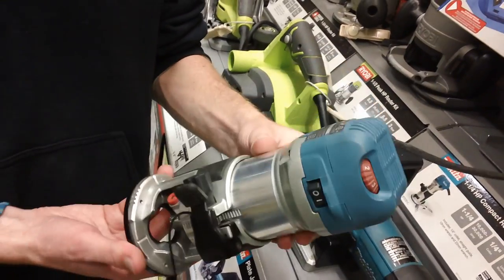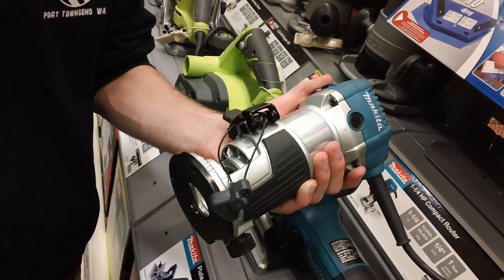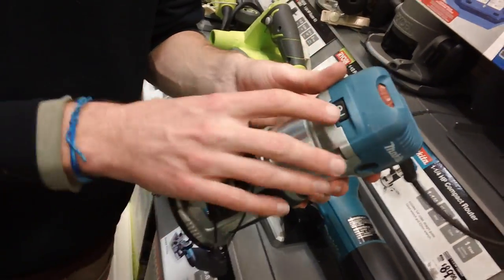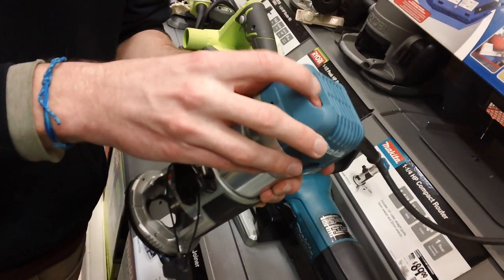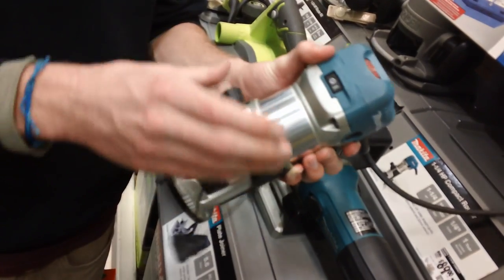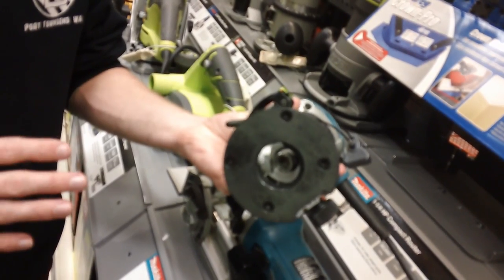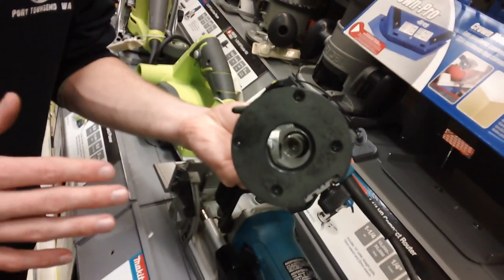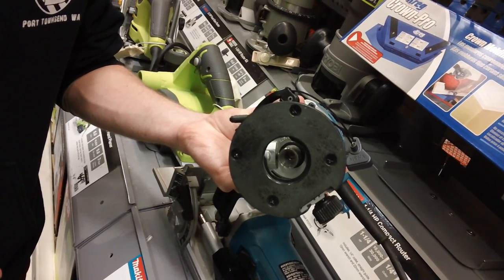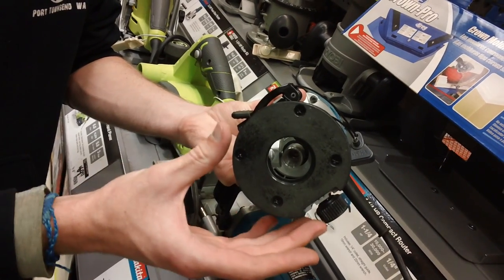The other category of routers out there are compact routers — I'm not sure I'd recommend these, but if someone wanted to try one that would be reasonable. This is a Makita one. It has a power switch on the front, a speed controller, a depth-setting mechanism, and a collet and base plate on the bottom. My biggest concern isn't their power — it's whether the base plate is going to be big enough to give you stable motion as the router slides. I think the answer is probably no; you'd need to make a bigger base plate.